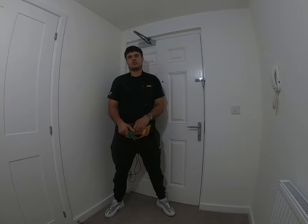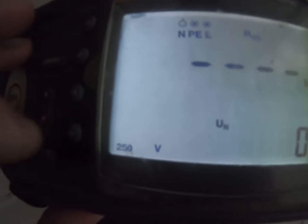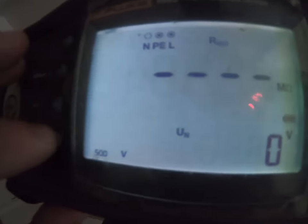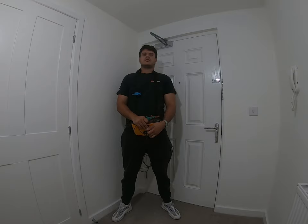I always do the board as a whole to save time — it will also give you the worst reading. If you get an unsatisfactory reading then do each circuit individually, though that can be quite hard work depending on the state of the fuse board. So I'm going to do my board globally: main switch off, RCDs off, MCBs left up, and all line and neutral conductors cross-connected. Start at 100V or 250V first — if there's a fault on, it's less likely to cause damage than 500V. If that's clear, then test at 500V and record your reading.